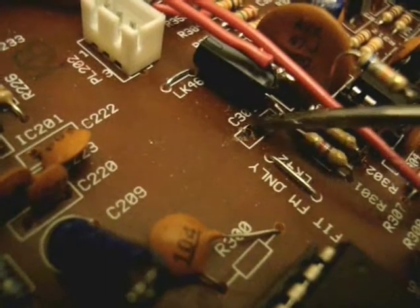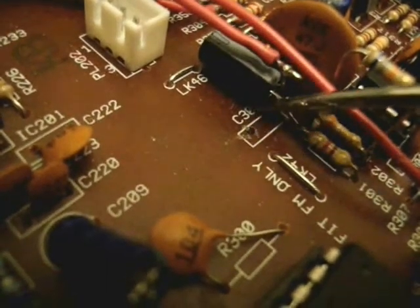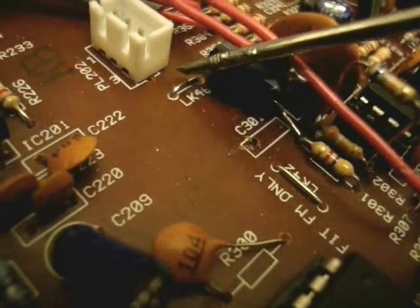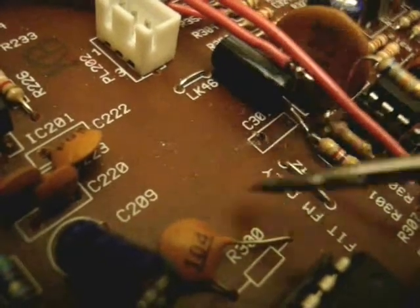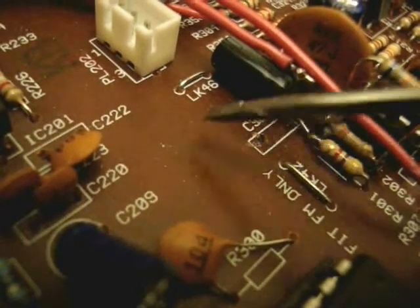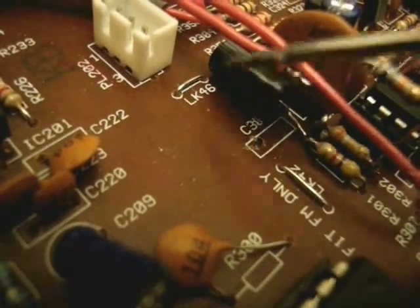There's TR304 — it's been snipped out, I just cut it out. That is the original modulator transistor. And that is the other capacitor I clipped out — C301 — right next to that modification. C301 is the 0.01 capacitor that was cut out, and this modification was added.